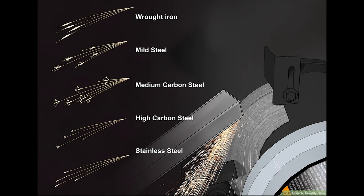So just to bring it all together — by looking at the color of the sparks and the physical appearance of the sparks, we can use that information to narrow down the type of material we have. Looking at this image, we can see the difference from wrought iron, mild steel, medium carbon steel, high carbon steel, and stainless steel in their spark pattern. Some seem to shoot out further before something happens at the ends. Some streams aren't as long, some are shorter, some are narrow, and some widen out. There are a lot of things we can look at to determine what type of metal we have.